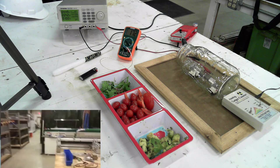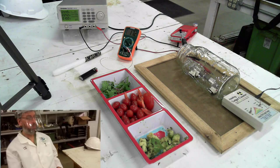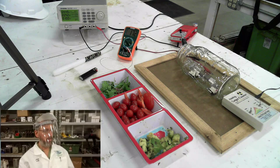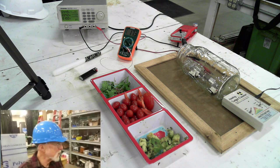Then we are probably in the 400, 500 PSI range. Ooh. A lot of it's going to go into the nickel, though, isn't it? Well, once it gets hotter. What temperature does the adsorption happen? Starts actually around 120 in the powders that I've played with. The finer the powder, the lower it starts. And this is 2 micron powder? Yeah. Which isn't terribly fine in the scale of things, right? Yeah, in the scale of these powders.